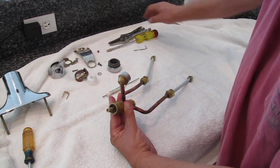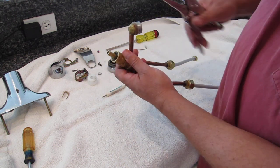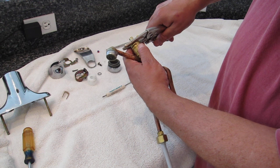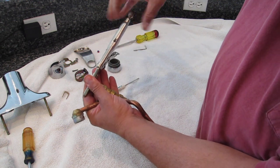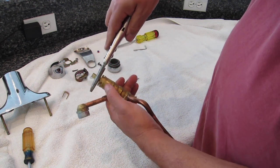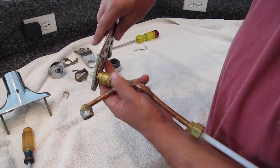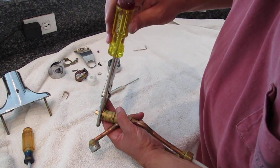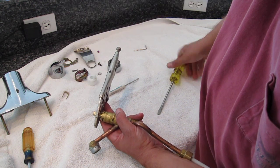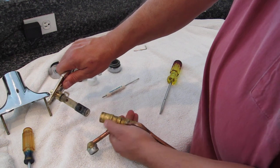This can come out very hard — it can stick, especially after it's been in there a while. Moen has a tool they recommend, but I used a pair of vise grips set to the shaft size and gripped it very close to the valve body, leaving a small gap. The plastic is aligned with the slots where the U-clip goes. Take a flat screwdriver, put it between the slots, and twist — being careful not to twist against the plastic — to start the cartridge removal. Then you should be able to pull it out. That is the piece we need to replace.